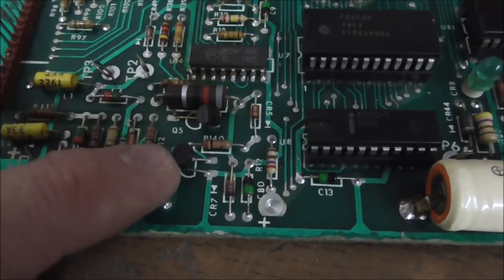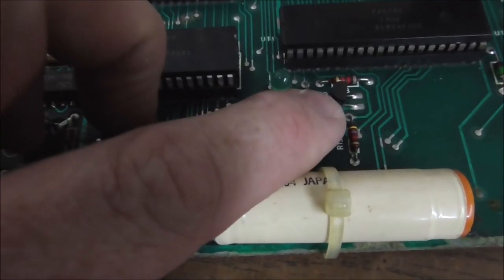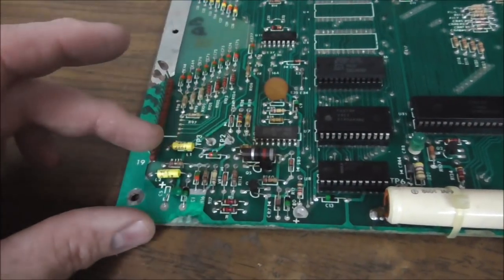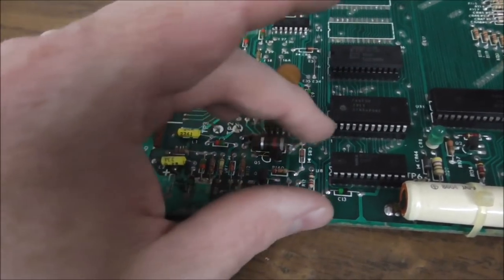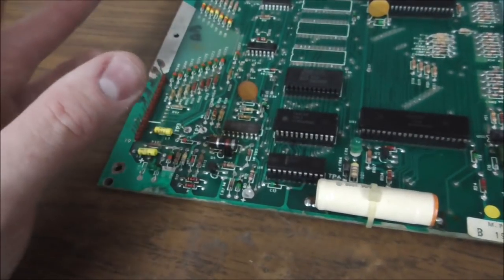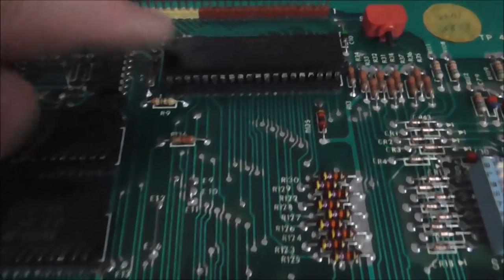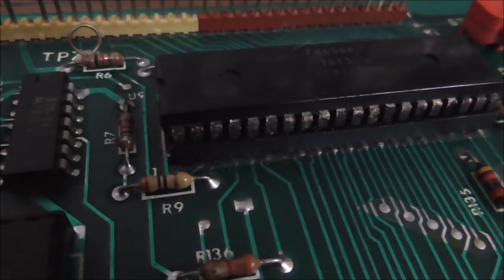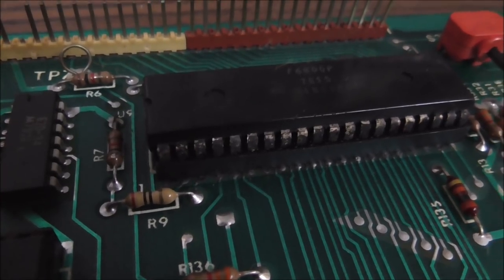There's three of them. This one, and this one. So if anything in this reset section doesn't work right, not counting that chip, this stuff and this, if anything in there doesn't work right, you won't get that first flick that you need. If the legs on the CPU chip are corroded to where they're not making good contact, like these are, you won't get that first flick.